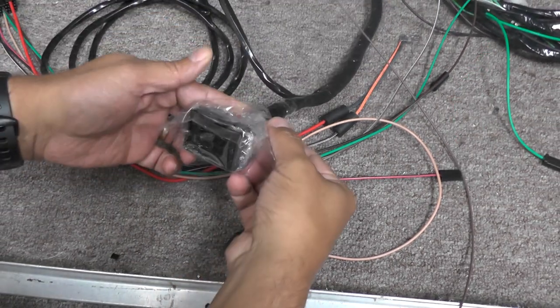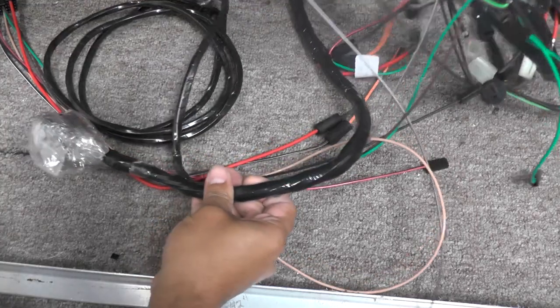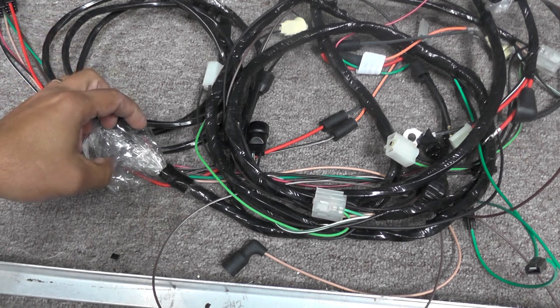This is what the final product will look like. The taping process will add the proper non-adhesive tape to the harness so that the individual wires within the harness are protected and to make routing the harness easier.